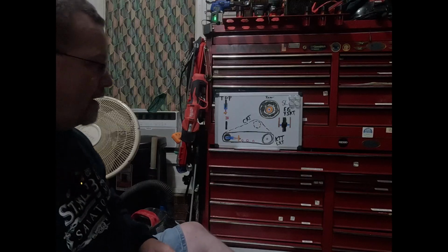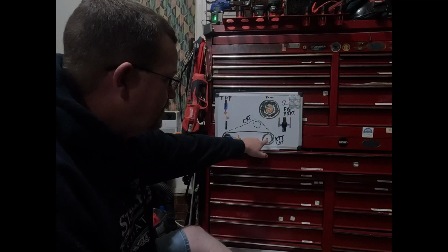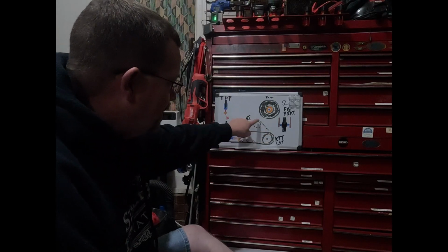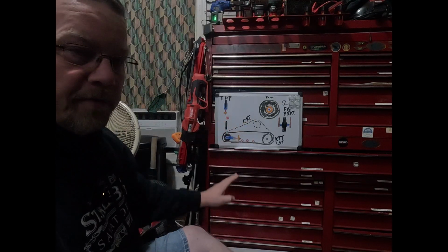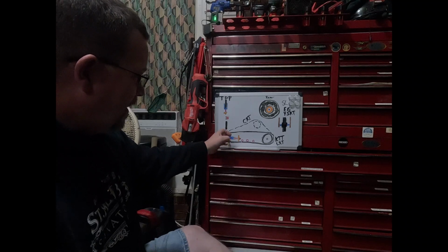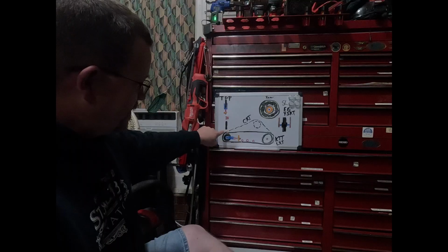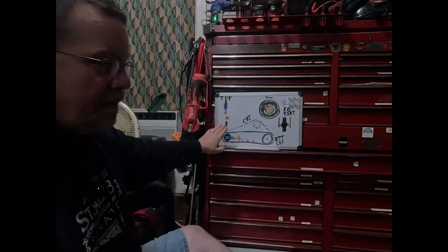Okay? Now you decide to go ahead and put the track on. Make sure that your idler is all the way back. Make sure that your drive motor, depending on which one, is secured and not moving. Start from the back end. If you have the CRT, come back this way. Bring everything up here to the idler. Some of them are going to be really, really close. I mean, it'll actually be just on this side of the wheels and you can't get it over there. And the CRTs, you can almost drape it right over with no problem. Maybe a little prying, that's okay.